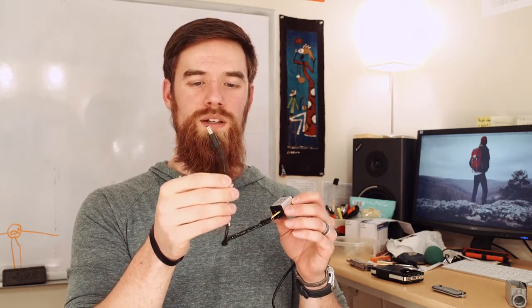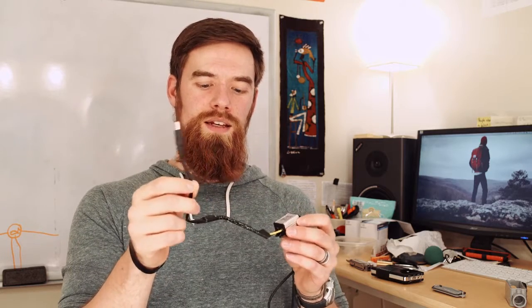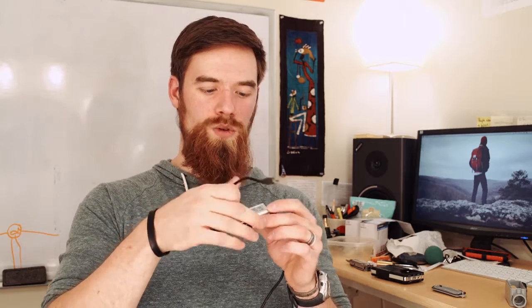It's super tiny and simple — it's got these two wires, an input and an output, just positive and negative, positive and negative. What I did is I took one of the DC power cables that comes with the battery — each one comes with one, so I had a few lying around — and I just snipped it in the middle and cut off some excess so I didn't have a huge cord going around, then connected it to the appropriate wires and taped it back up.